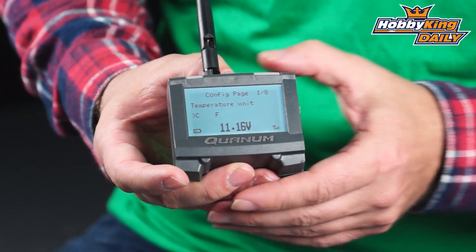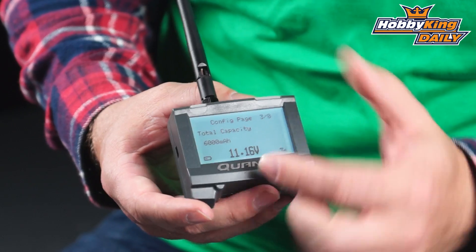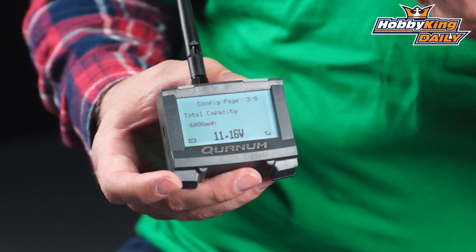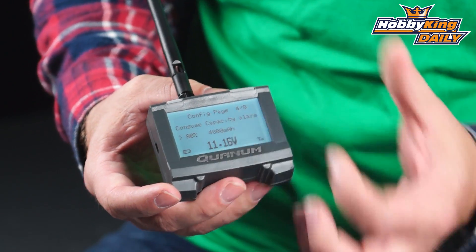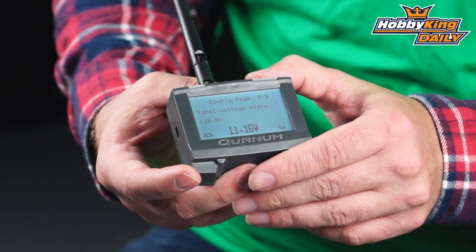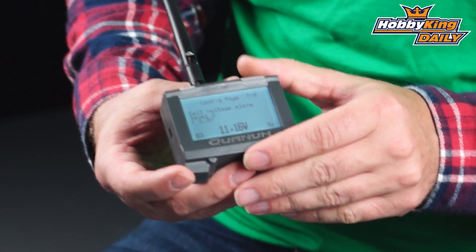That temperature option is available under the related items. Now this is capacity display mode — instead of battery voltage, it gives you a percentage of the battery. In order to do that, you have to input your battery capacity, so if you put in that you've got a 6,000 milliamp battery, it can actually monitor via the amp gauge and show you a percentage — 80%, 70%, 20% — and indicate the alarm at whatever point you want it to kick on. You also have a consumption capacity alarm, a total voltage alarm, as well as an individual cell voltage alarm. So if any one individual cell drops below your threshold, or if you have one cell going bad, it will give you the indicator on that as well.